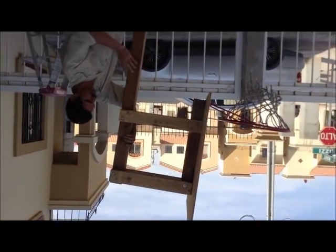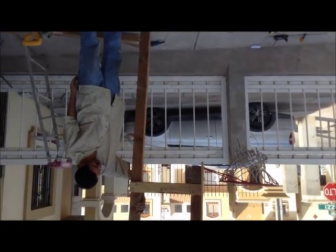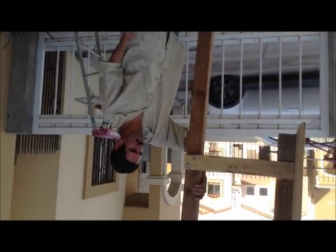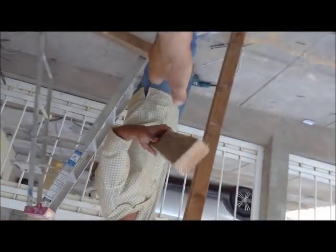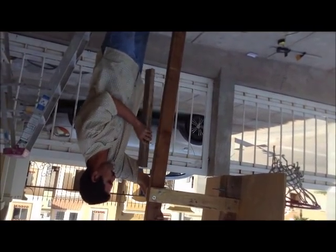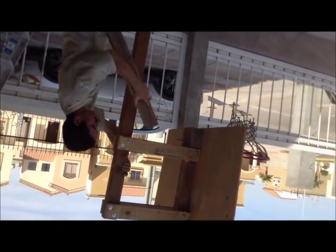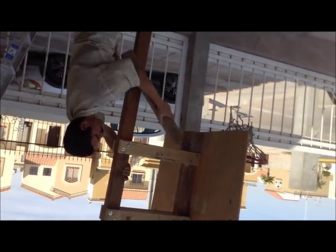Oh. All right, here's the basketball court now. Now it looks like we got some space to dunk. So, now, Robert, what did you say we gotta do? Okay, give me the 2x4 right there. Any 2x4. This one we're gonna cut it in half, and we're gonna put one piece right here, like about this much, and then same thing on this side. And then you're gonna put one across like this. Bam! A screw to here and a screw to here, on both sides. Like that, we won't have any flex.